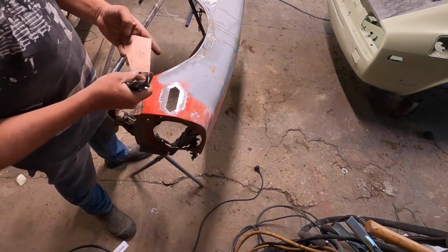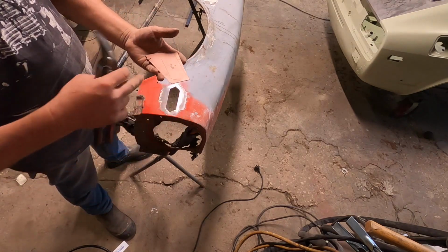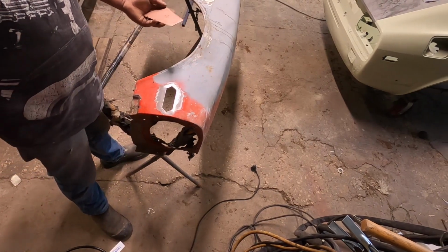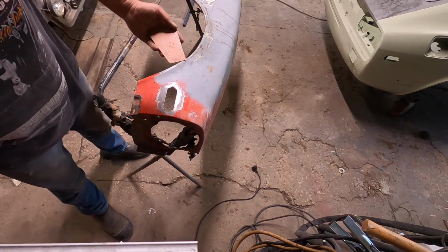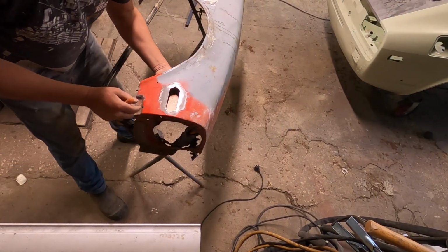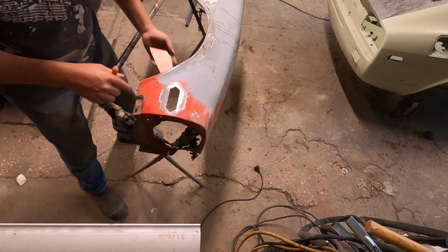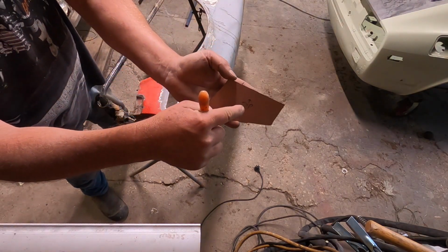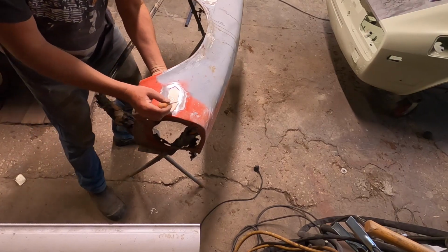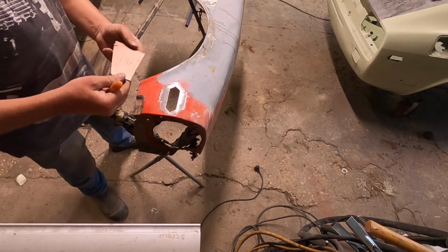Right, so what I've done here, got some 1mm cold rolled mild steel. I've just dusted over some primer, some copper spray, just so when I scribe this out with my scribe, what I did was I pushed it up as hard as I could, and I just scribed around the outside, and I've marked on it what is the top, and obviously you know what the bottom is. So yeah, top, simples. Anyway, I've got to cut it out now.